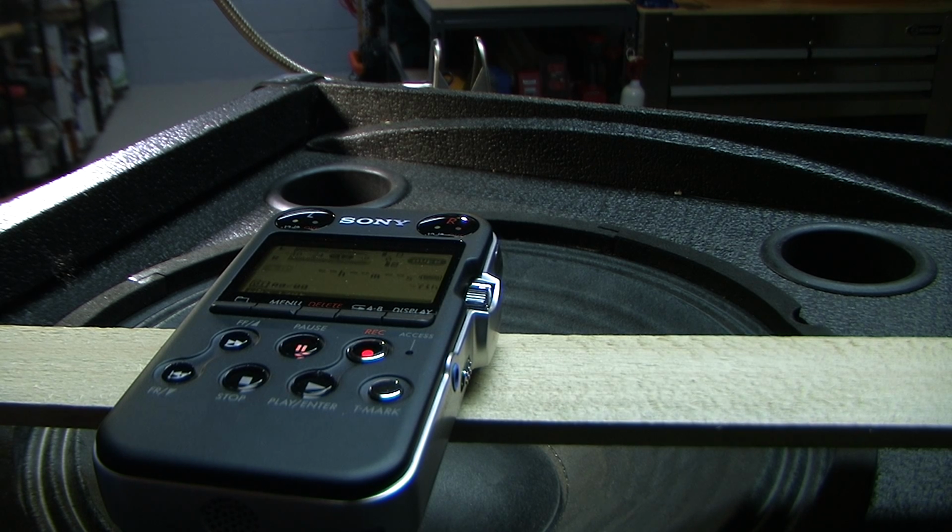It gets louder there. Okay, there's where it starts going down, watch. Okay, right there where it starts going down, that's 4, right there, that's 4 kilohertz. 2, 6. So I need to get to -9, and I'm there, and that's exactly at 4 kilohertz. It's actually -13 now.